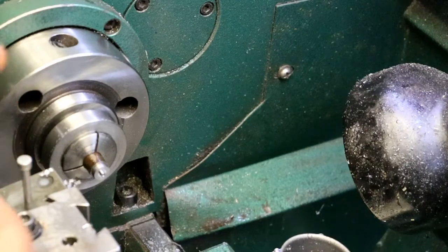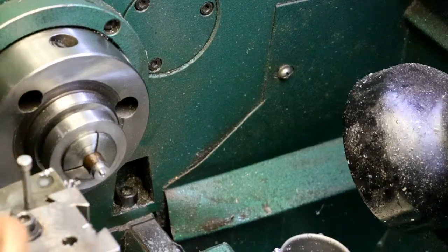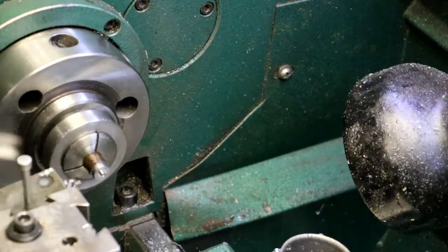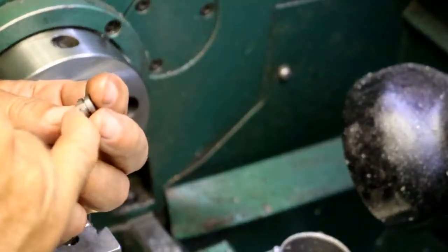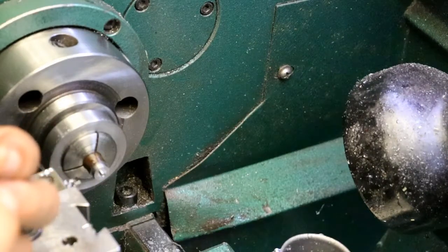Okay, so there's the piston with the marks in the end that it's not going to hurt. That little groove that I did with the... I'm going to check that to make sure I got the right width. 230, right on the money. And this should be 80. And this should be 80. Okay. So now I need to make a little tiny Teflon ring. I'll have to sit down and calculate what the diameter is going to be with my slitting saw going through.